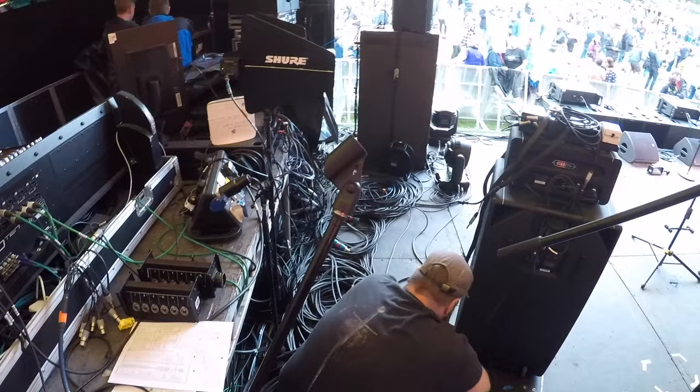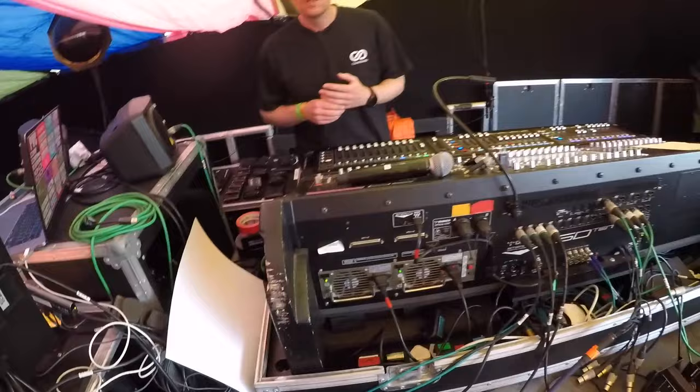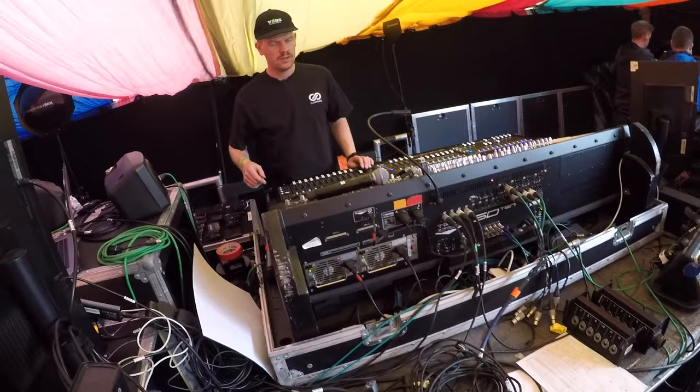And anyway, we did a lot of testing, a lot of troubleshooting. In the end, the only problem was that the show file recalled from the desk in front of us was not in 96K. It was 48. So we changed that and basically it worked. So you will hear on a sample, I'm saying, what was the problem? Oh, it was 48, but we need it to be 96. I think that's the problem.